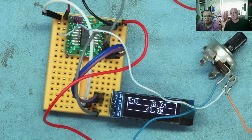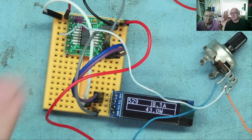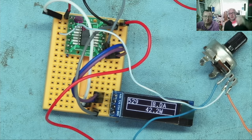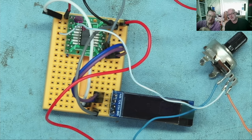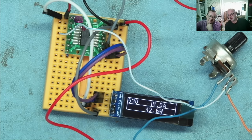In actual fact, because of the LDO, the voltage regulator, we're trying to limit the current to limit the wattage dissipated. You said you actually slowed the processor down on this. Yeah, this CPU is running right now at 1 megahertz, and you can see the little display gets drawn from the bottom to the top because it's so slow. If you want a faster display, this is easy. Watch how this draws. I pressed the button more than once. Oh, okay, you can switch.